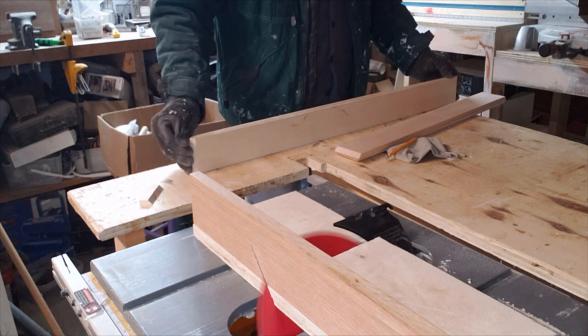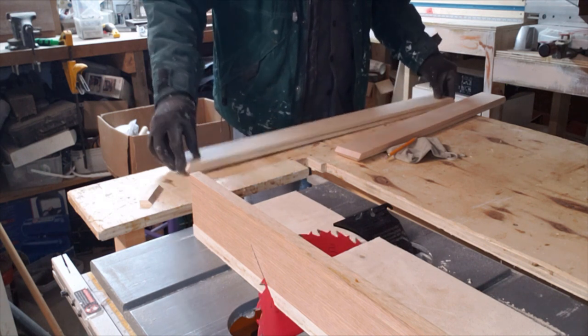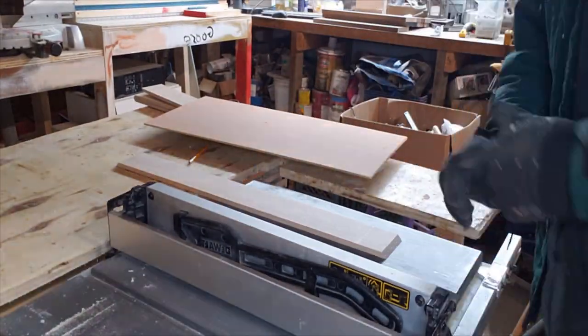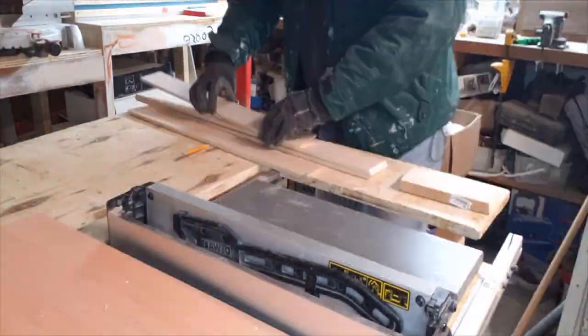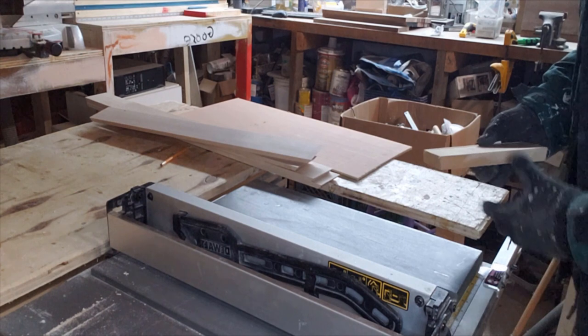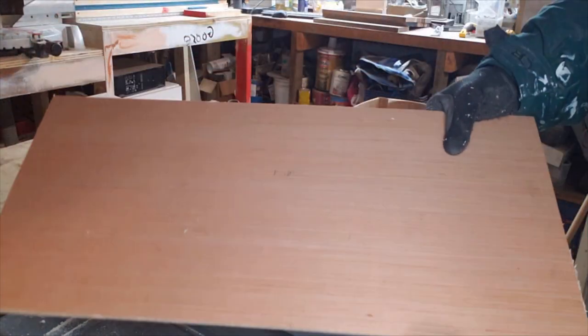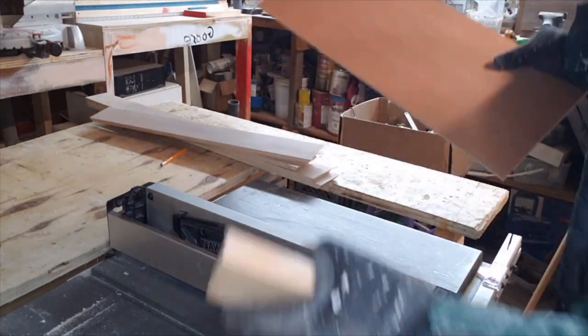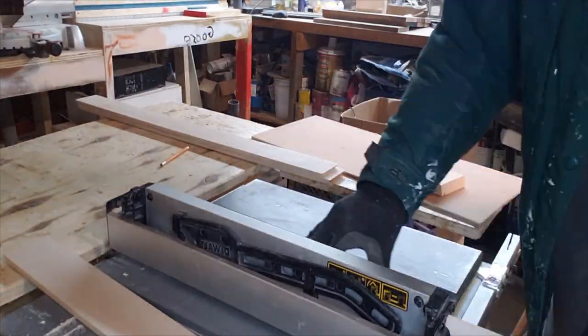You can see I'm laying them back to back and making sure they come to a perfect point. These are going to need a few grooves cut into them at the table saw. We need a groove along the bottom to hold the bottom panel, a groove along the top to hold the top panel, and then I decided I wanted to inlay a strip of walnut along the outside for a little added interest — I've never done it before so I wanted to try something new.